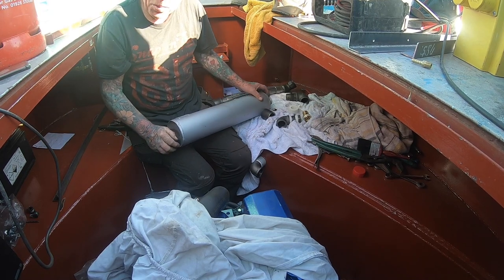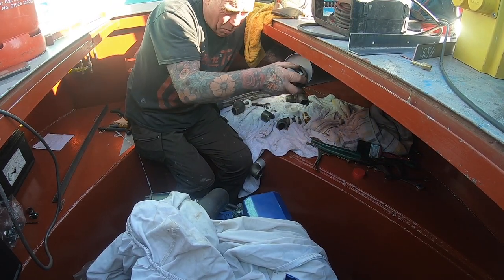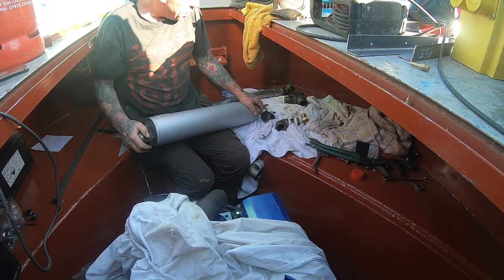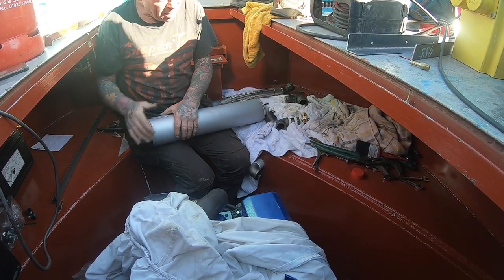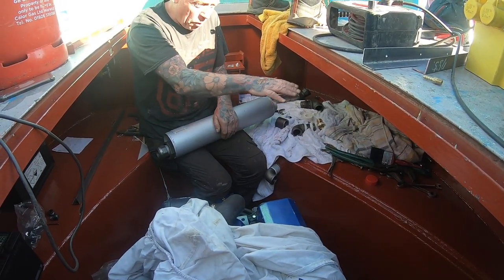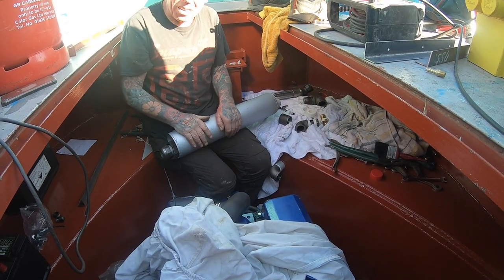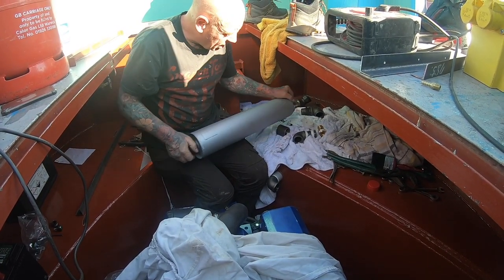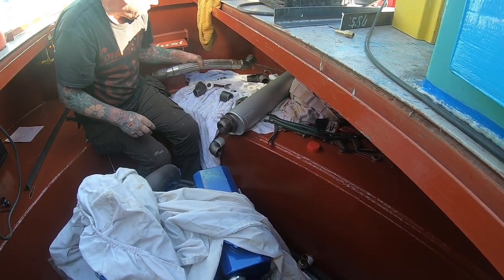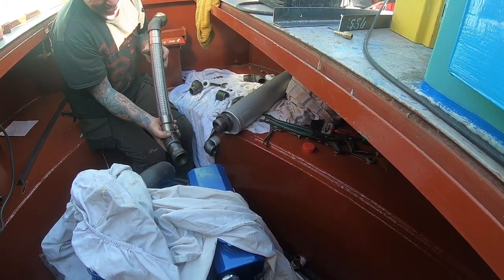And there's not much room under it. You don't get much room underneath there to make that go up and down, because if you make it go too far down, it's too low. As long as you've got 10 inches above the waterline, and if it comes up here, that counts. Same as the sink. Don't make them easy, these boat builders, do they? No.